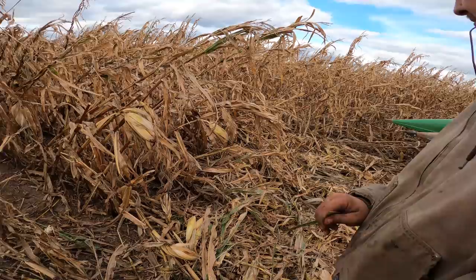We just did our first 100 feet with the corn reel. And I think it does about as good of a job as it can do. It does do a pretty good job at throwing stuff into the head. The only problem is that you're getting more corn stalks and stuff through it, which is going to be a given with downed corn.